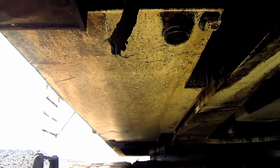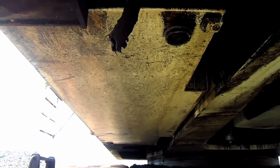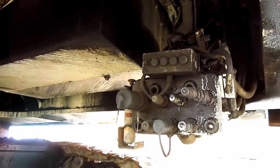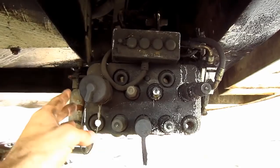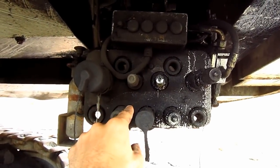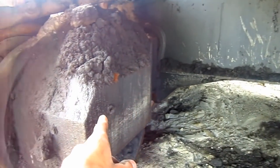Mounted below each diesel engine alongside the machine's superstructure are two 1,416-gallon diesel fuel tanks — one on each side — which supply the engines with fuel. The RH120E features a centralized service fluid filling station. This hydraulically powered drop-down is a plug-in for the fuel man to fill the machine with service fluids such as diesel fuel, engine oil, grease, or coolant, without having to take fill lines up to the top deck. From under here you can see where the two travel motors are located, one on each crawler frame, which propel each individual track.